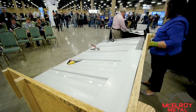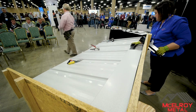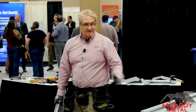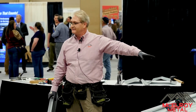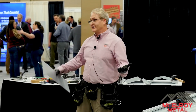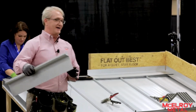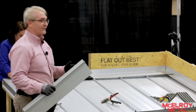One thing to understand about when you're actually ordering panels for standing seam is you need to be pretty on. You got to be pretty close. Okay. Should I panic if my trim is 4 inches short like that? No. What can I do? Order a bigger ridge cap. Okay, a little wider. Unfortunately, I've seen some crazy ones out there. They're like 2 foot long or 2 foot wide on each side. Don't go that bad, please, but get close.